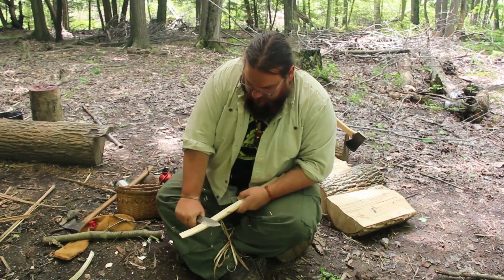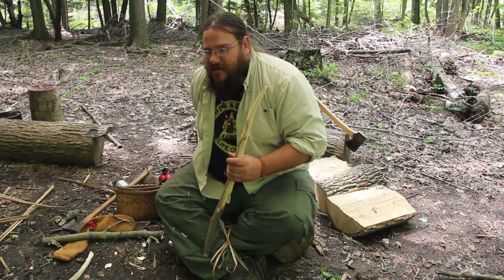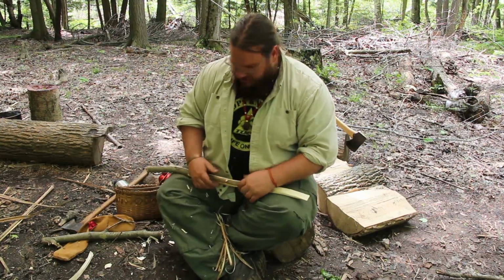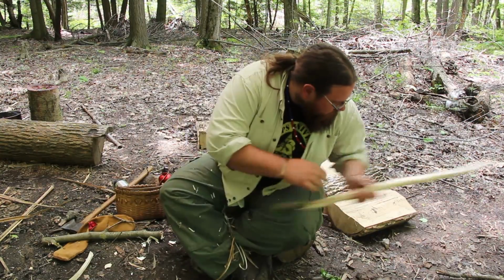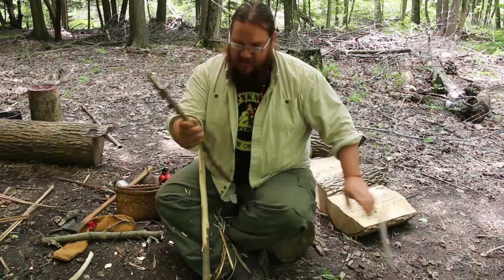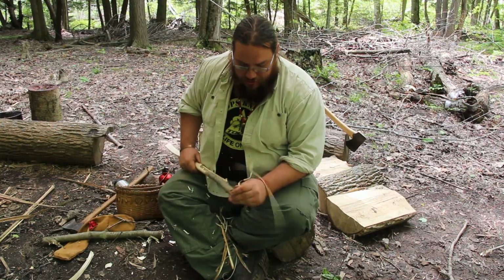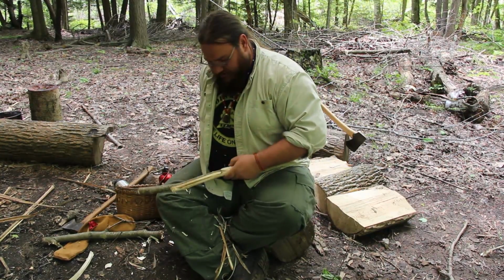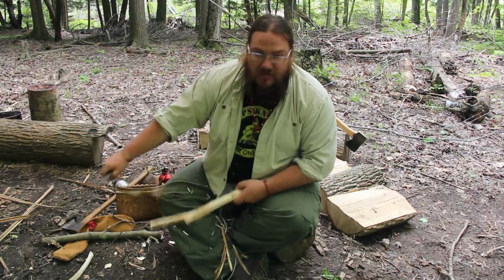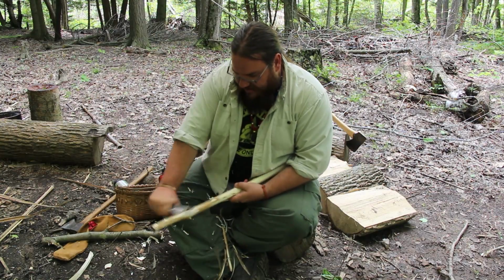And you can make them big, you can make them small. I've seen guys peeling willows and smaller trees for rope, like basswoods, small basswood trees, and they're just using a stick, like pretty much that size, and that's their spud. I've seen people who are peeling huge hickories and tulip poplars and making shingles for wigwams and longhouses, and they make them the size of shovels. They're massive. And I've used both sizes because a spud is for whatever size you need.